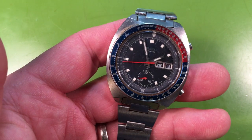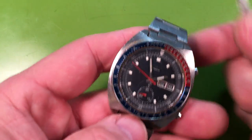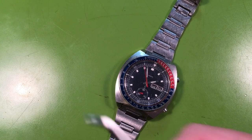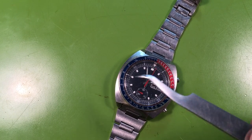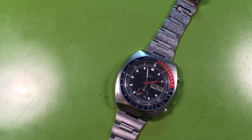But it's got to be serviced, which of course you knew. It's a good watch. It needs lower mainspring arbor port repair, needs to be serviced, the barrel is stuffed full of old grease, it has a bad intermediary wheel in the calendar, and it needs all the other stuff — case rebuild with seals, crystal, cleaning, and that kind of stuff.